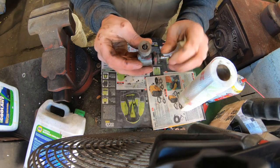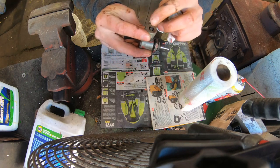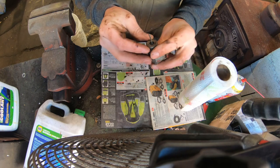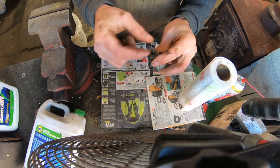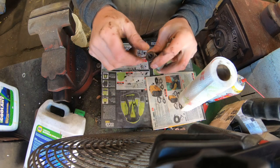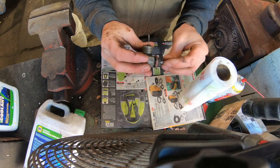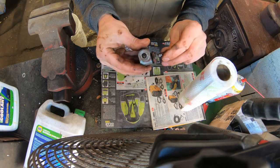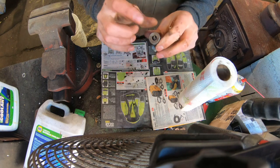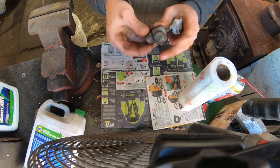You can see a piece rotating. Normally I think the cable's pressed to a square shape, and I don't know, must be the cable got stuck in the sleeve or something and something had to give, which the cable itself was the thing to give. It ended up getting twisted and breaking off. That's why the tach no longer functions. So I'm going to blast this off with a little bit of compressed air, and I guess I'm just going to keep yanking on this thing.